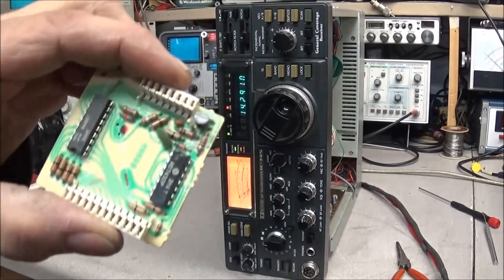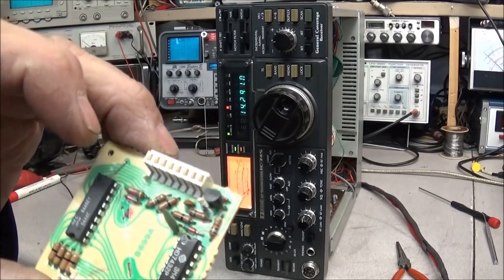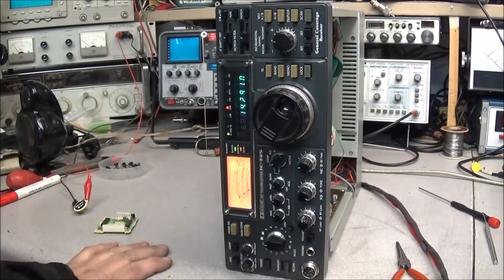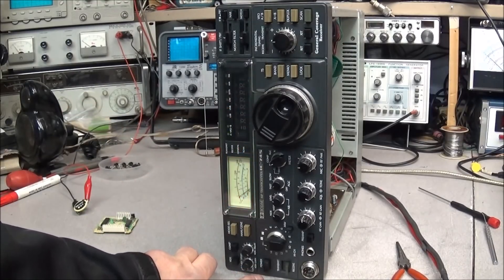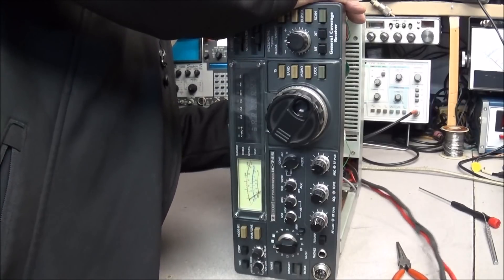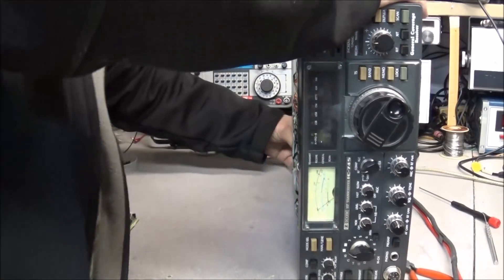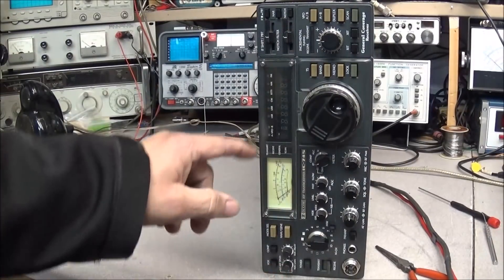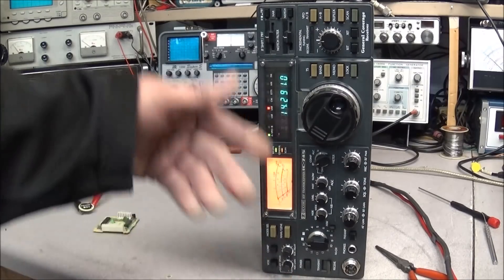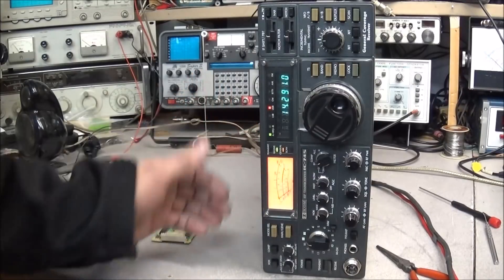To do that, I have a RAM board with no battery installed. This board will be completely dead because it's lost its base programming. When the static RAM is gone, usually when you turn the ICOM on — I'll unplug it and let it clear out everything, then plug it back in. If you notice when I turn this on, you'll see there's a delay in when the frequency pops up. There — now the frequency came on. That's because it's reading what's on this RAM board and putting it into the main processor.